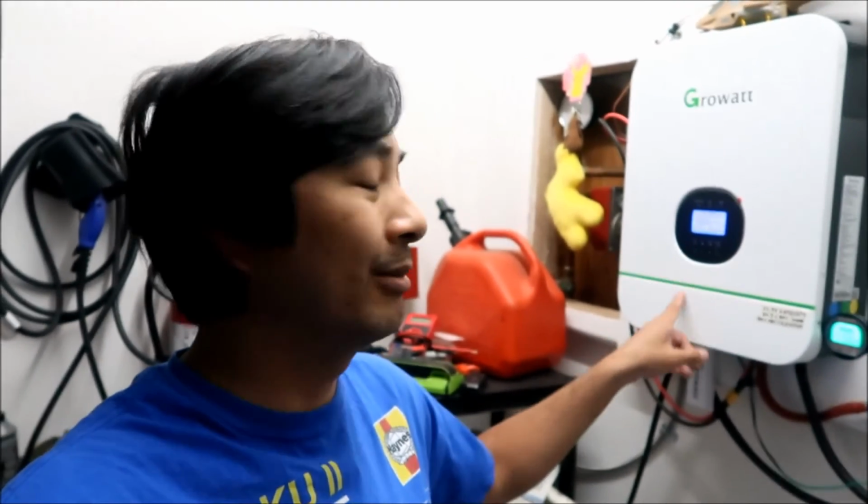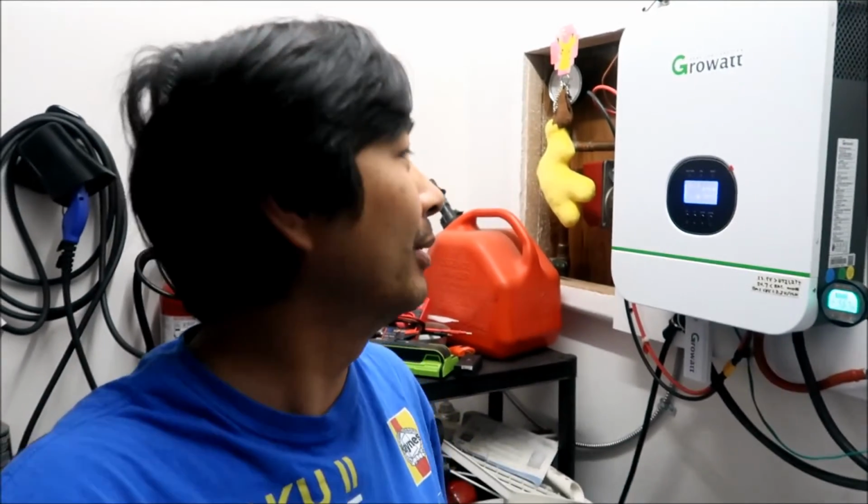When we put it in parallel, it pretty much doubled the current. So 7 times 2 is 14, so there should be 14 amps, like it said on the current clamp. I would say that's like 20 amps maybe, just to be safe, of your 50 amp capacity for that wire. We could still double the output. We could probably put out like 3 kilowatts. And if you get another inverter, you could probably add more because you'll have another charger on another unit. So yeah, I'm pretty happy with what's gone on.